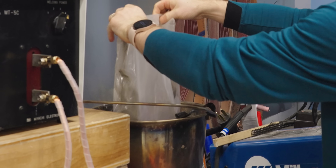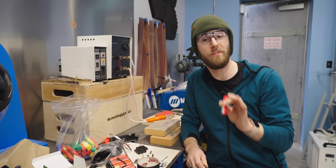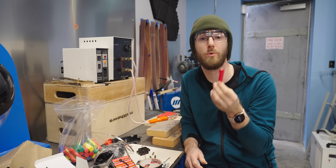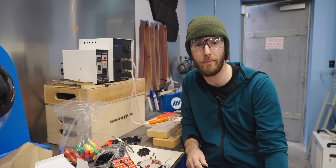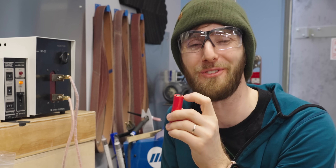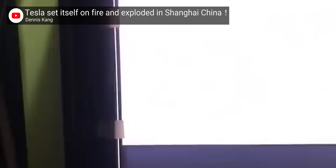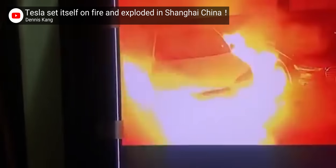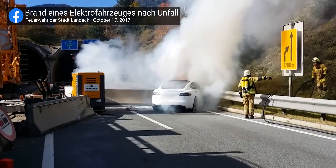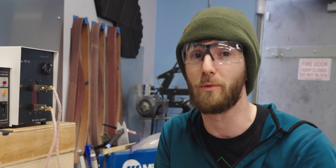We popped a cell. I think I didn't clean the tip often enough. That was a bummer, but the good news is the video's not over. We had a backup plan, because we knew going in that lithium batteries are much more volatile than the nickel metal hydride batteries you might find in old power tools. Not only are the cases much thinner, but the lithium inside is chemically much more reactive. You've probably seen videos of electric vehicles bursting into flames — that's a lithium battery fire and it is no joke. Not only are they essentially unextinguishable, but the smoke is toxic too.